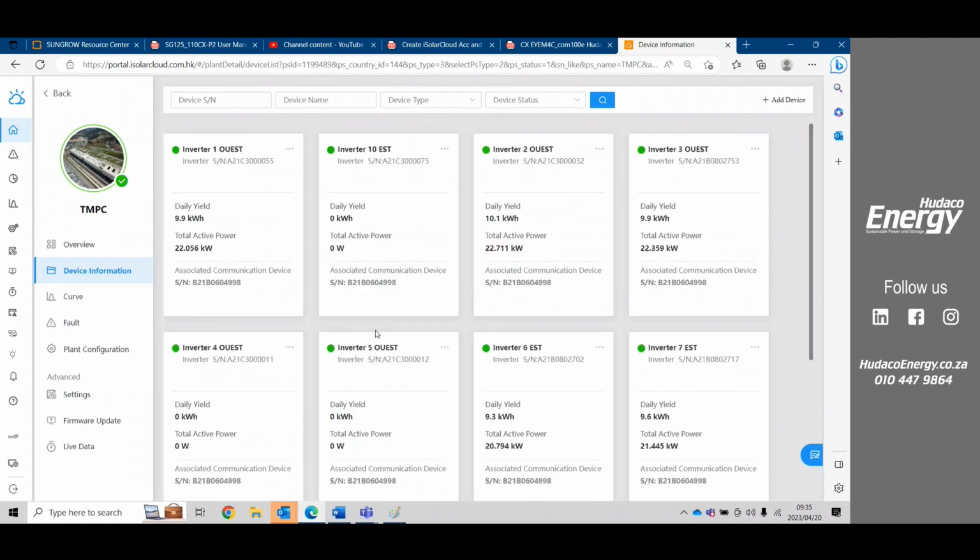This is potentially an IPP plant, so they just want to produce as much power as possible. They probably have a bidirectional meter or a 4-quadrant meter on the gateway. So the municipality is probably monitoring, or they're monitoring on a different platform, what they're producing. It's always in their best interest to have a look at a third-party monitoring device so that they can cross-reference and not always rely just on the Sungrow values.